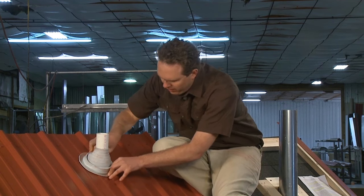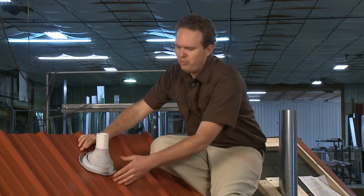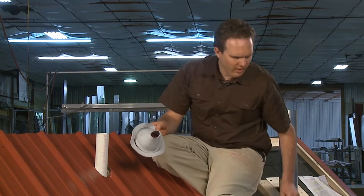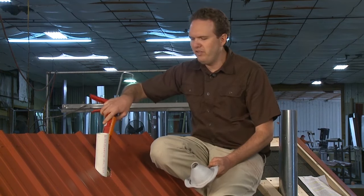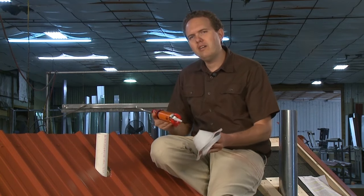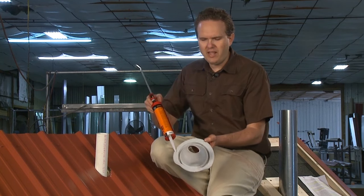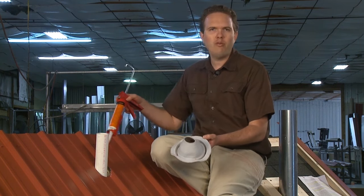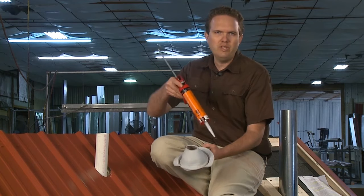Press this side down — that's about how it's going to look when we put the screws in. Once you've got the dry fit done and if your hole is small enough you might want to put a little sealant back behind the pipe to fill the hole. Definitely apply some sealant to the bottom of the boot. Putting it on the underside on this fat lip helps ensure the sealant stays out of UV light and weather, making it last a lot longer than if you only put it around the outside. Put a good amount of sealant around the inside of the boot, starting a little more toward the inside of the pipe so it doesn't all squeeze out when you press it down.